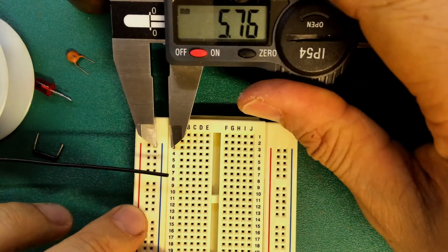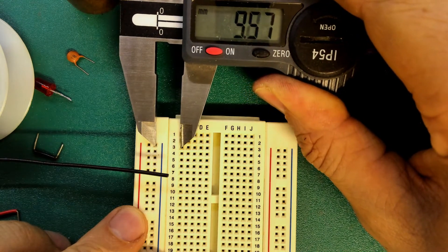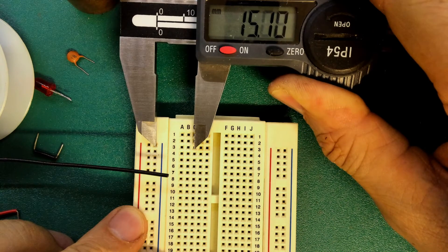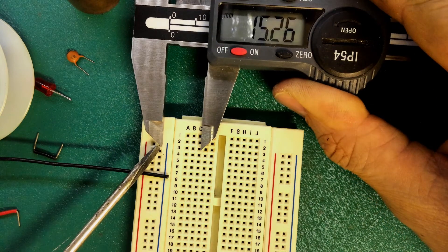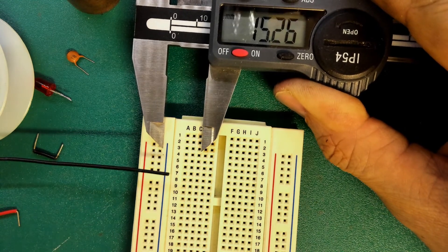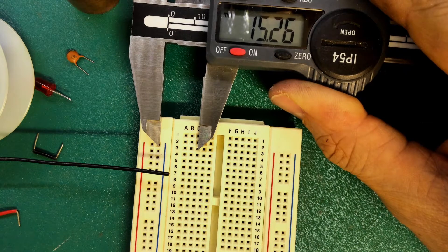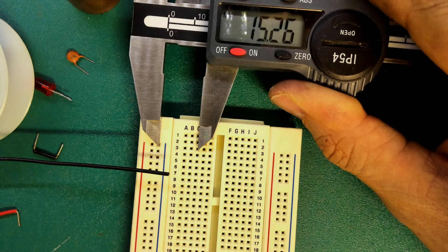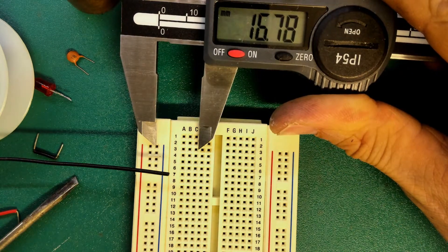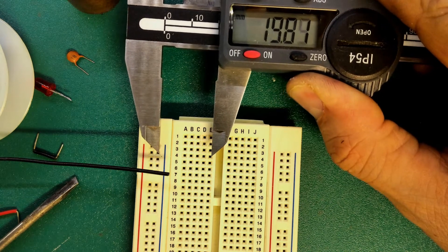What we want to do is make a jumper wire to go from our earth pin out to our breadboard pin — let's say column C, our ground rail, to the edge of column C. You can see I'm giving it a little bit more space than what's needed. We need to add an extra 10mm, which will give 5mm either side for the leg. So if we push this out to 25mm.